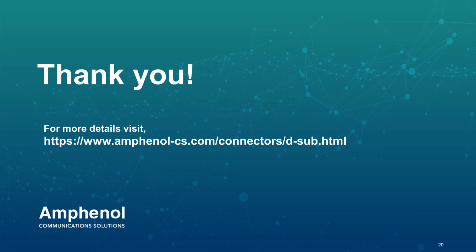What are the key benefits of a D-Sub SMT connector in regards to cost? Though the parts cost may be slightly higher compared to the standard through-hole solder version, customers can achieve a lower total applied cost due to the workflow process and automated pick-and-place arrangements, which saves process time. So at the end of the day, the customer benefits from using SMT connectors.